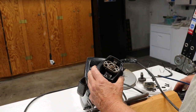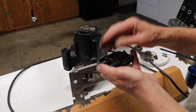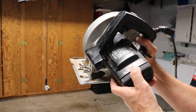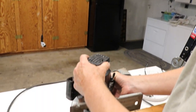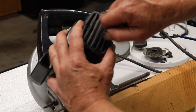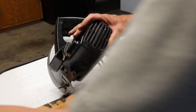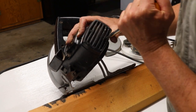So to reassemble, we take the two rubber plugs and put those in the holes, then put the motor cover on top of them so they don't fall out. It feels a little weird but that's because I'm pushing those plugs together — they want to push the cover apart, which means they're working. Then we just put the screws in and hold it down. I like the ratchet on an adjustable drill to give up quite easily, and then I like to finish by hand because my hand is calibrated — I know how tight the screw should be and I don't want it overly tightened by the drill.